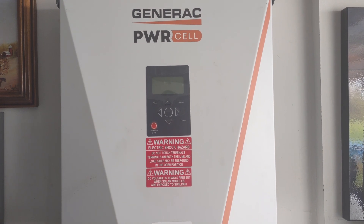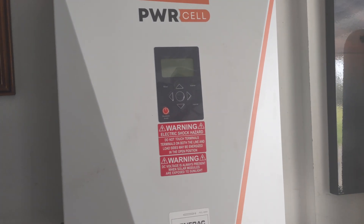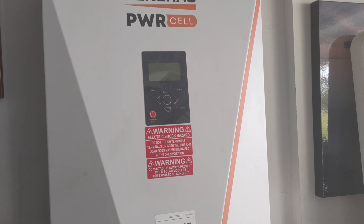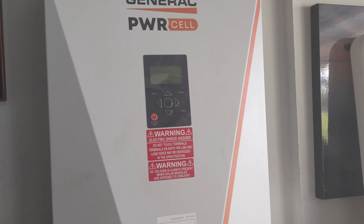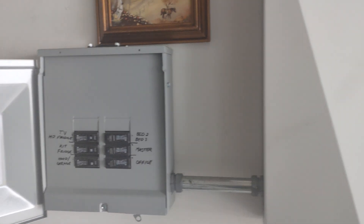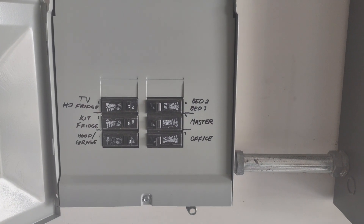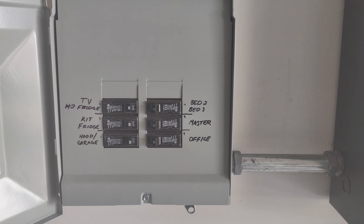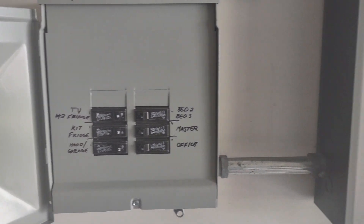This does take a couple of minutes. While we're doing that — just so you guys know — if you ever have to replace one of the internal items, remember it does take a little force to get those back into place, the internal bussing and internally here. This particular system only has a couple of breakers running the house, so no big heavy loads, which is why we don't have the Generac transfer switch hooked up to this particular one.